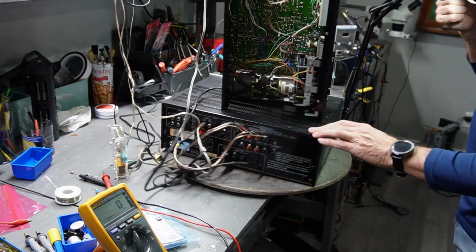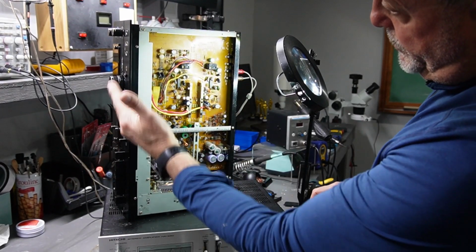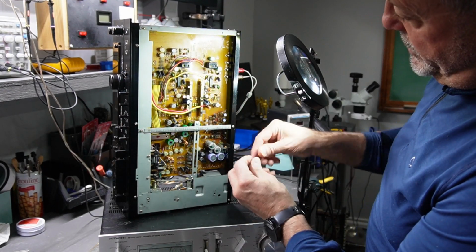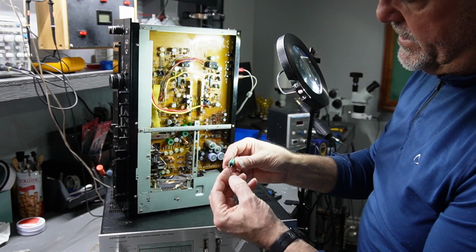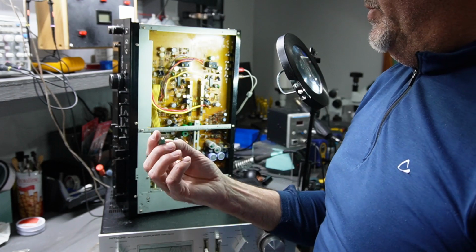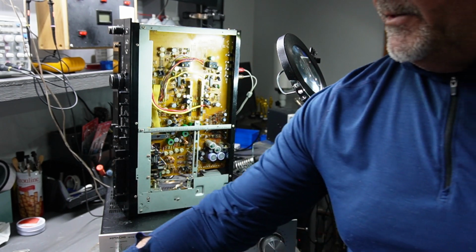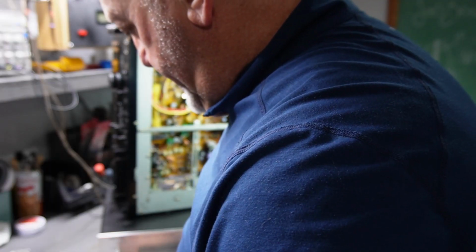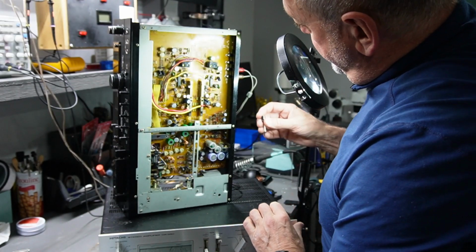If you guys noticed, I'll bring you guys around this. This is where I replaced the 2 capacitors for the right channel. And you'll notice this green one was right here. It was kind of crooked. Looks like this was pulled off, so I'm going to replace this. This is a 220 microfarad at 16 volts. Should be able to find that in my shop. Yeah, this is only 16 volts and I have them right here. These are good capacitors and we'll change that for sure.